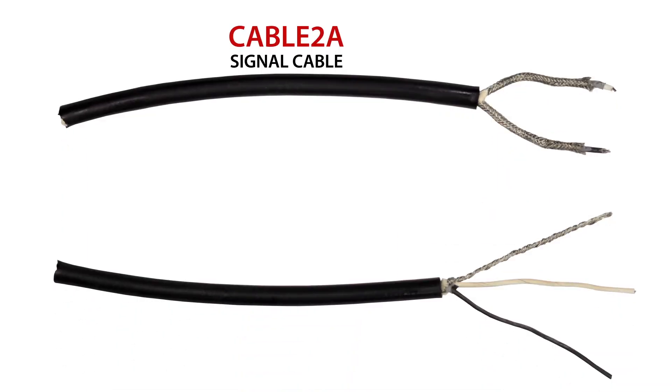After stripping the outer covering from the cable on both ends, the braided shields are loosened and the conductors removed from the interior of the braid. Then, the two braids are twisted together and now form the conductor labeled G. Make certain that the conductor is connected at both ends.